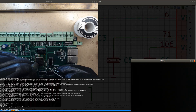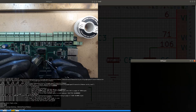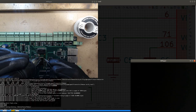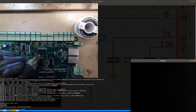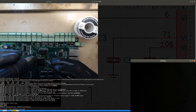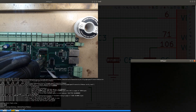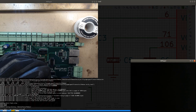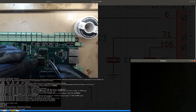This chip is going to be perfectly soldered by the time I'm done moving it. So everything is starting to reflow properly. But I still need to move it just a little bit, because it's not entirely straight. What is going on? Why is it not moving? Where is all the heat escaping? I can't even lift it off, not even by the corner. Oh, now it's moving, awesome. This probably was one pin or something that was stuck.